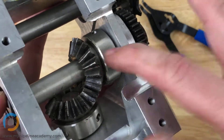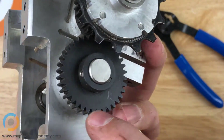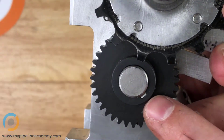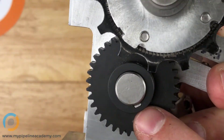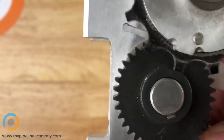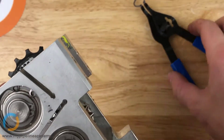Side note: here's another set screw right here — we've got this spur gear onto a shaft. And there's a little key right there. We talked about using keys when looking at one-way ball bearings, but keys are used in gears a lot as well. That key is half in the gear and the other half is in a slot inside the axle — that keys them together and prevents relative rotational motion between the two. Anyway, that's retaining rings.